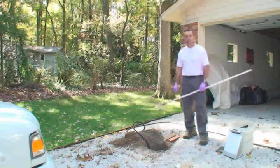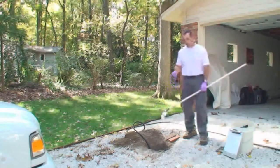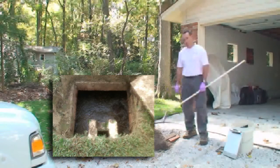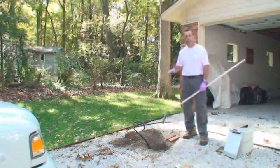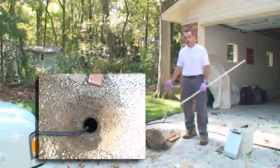We'll use cameras and mirrors to inspect it. In addition to that, we'll measure the sludge levels, see if the tank needs to be pumped out, and monitor the working level throughout the inspection to make sure that the water level in the tank stays constant from beginning to end. We try to run a day's worth of water into the tank during the inspection.